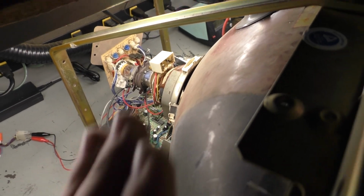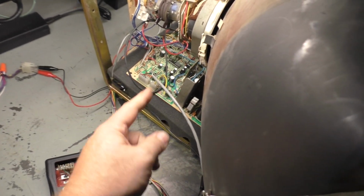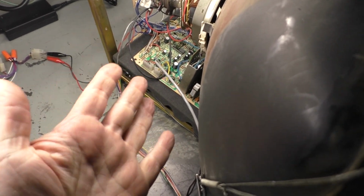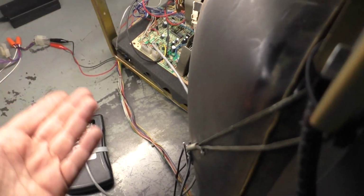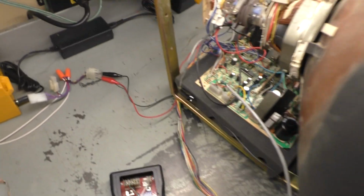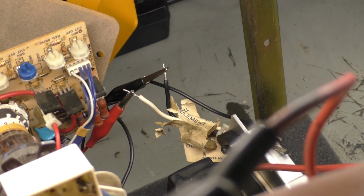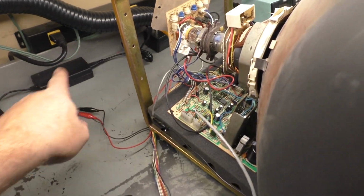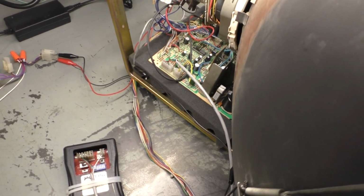All right, so we're back on the U5000 tube. I've mentioned before this will work just fine. I got the foam there as an insulator. I have everything hooked up: anode, neck, yoke, ground, power, video, remote. We have our test pattern generator to turn on just in case it does operate, so we can get a signal and see what it looks like. So let's turn that on. The power is hooked up rather precariously because there's no connector, but everything's separate and should work. All right, I am plugged in, so we should have 115 feeding the chassis. So let's see if it's operator error or if in fact it does not turn on.